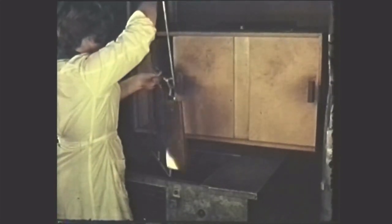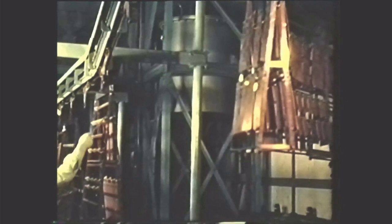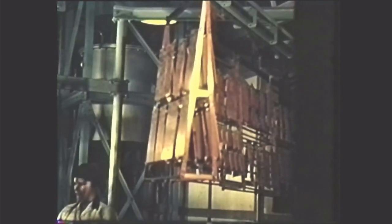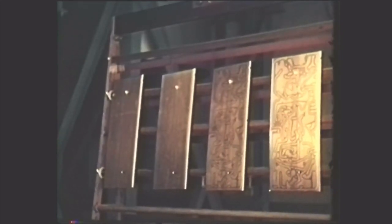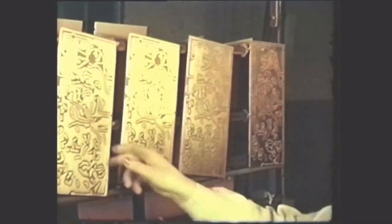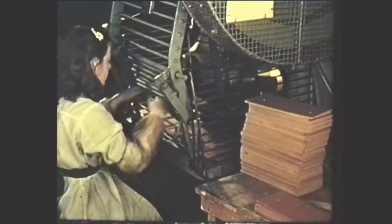The panels are developed by dissolving the unexposed coating. The remaining image will act as a mask to an etching solution, which removes unwanted copper from the panels. The boards are seen travelling to and from the etching machine. The continuously moving conveyor carries racks of panels through an etching zone where the panel faces are sprayed with an etching solution. Thorough washing follows and the boards are then dried. After unloading, they are date coded and the 300 component insertion holes are punched in one operation.